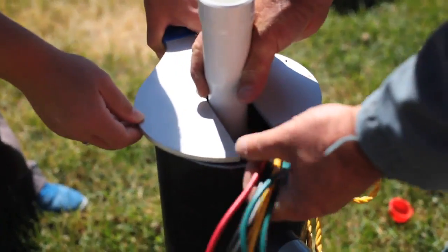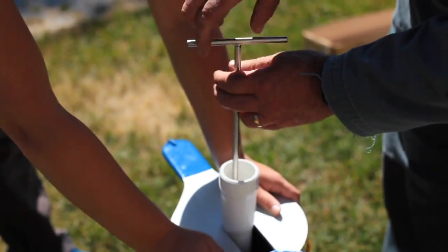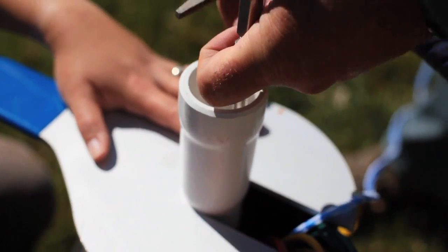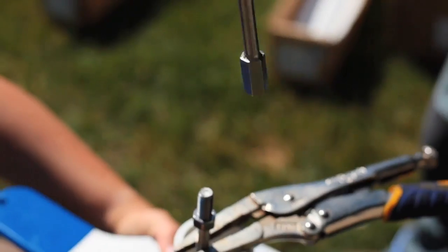This tool grips the flared top end of the pipe so that it stays put while we're working on it. Here I'm using the rod extraction tool again to pull up the rod that's now connected to the pumping cylinder. I'm putting some vice grips on here just to lock it so I can make that all-important connection.